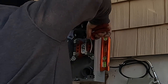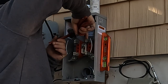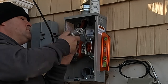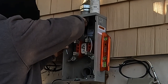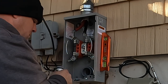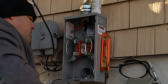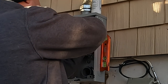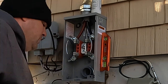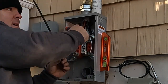Before I cut them, I'll mark them so I know exactly where to cut the first conductor, then take my cutters and cut the other one to the exact same length. Then I'll get my Klein stripper for 4/0 aluminum - which is what this cable is - and strip back the cables. I'll get a dry fit before getting the Penetrox on there, because it does get a little sloppy. Even if you wear gloves you're still going to be slipping. As you can see, I apply plenty of the antioxidant on the conductors before trying to get the seal on the connector.